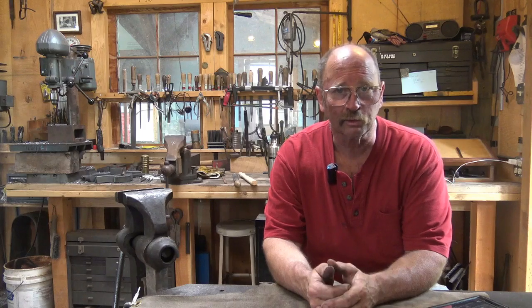That's our video for today. We've talked about hammers and what makes a good hammer in the previous video, and we've talked about the tools needed to make a hammer in this video — these being made from scrap steel. Again, if you can afford it and have a source, buying new steel is more reliable: you know what you've got, you don't need to go through the test procedure, and you're less likely to have failures. But blacksmiths love scrounging and scrap steel, and it's good recycling. Just be cautious and make sure you wear your safety glasses, because if you get the hardening and tempering wrong, you could be sending chips flying around the shop. We'll see you later to make a hammer and I'll show you a few little tricks to make hammer making easier for the novice.